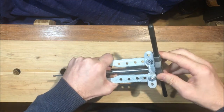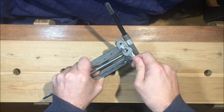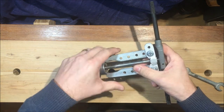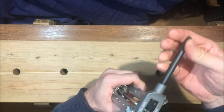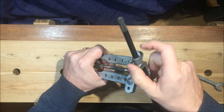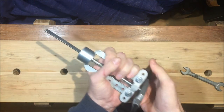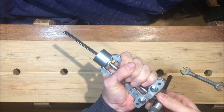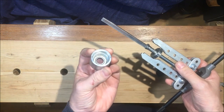Let's see if this thing works. I'll wind it to that point and tighten up these so we don't have any slippage or danger. Those arms are actually quite tight - sitting on there nicely, length seems consistent enough. We've got our tap wrench secured. Now we can start pulling that bearing out. I'm screwing it - need to screw it the right way, opposite direction. I can hear some movement - and there's our bearing starting to emerge. Look at that, it's working! That is exactly what I needed to achieve. Bearing is out. And there is a step in there.